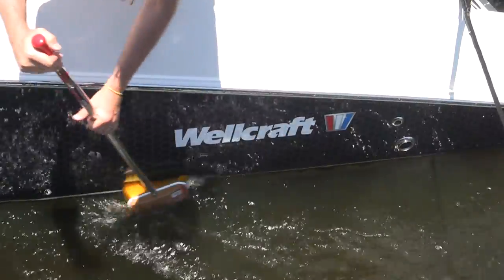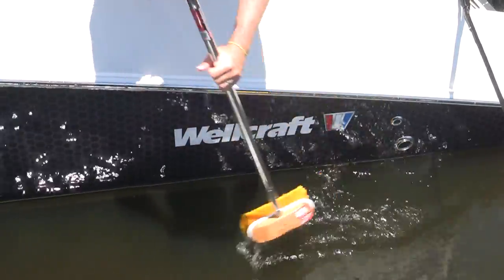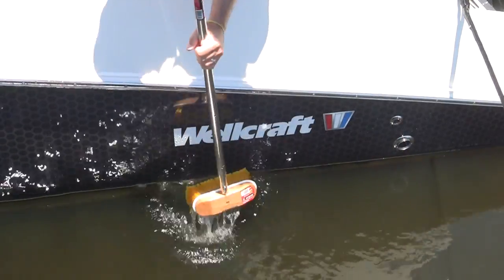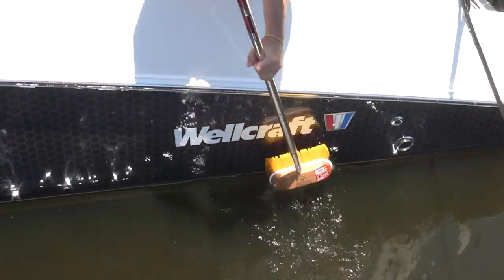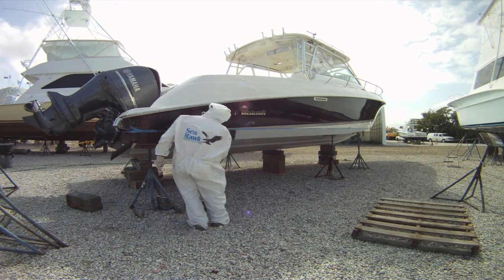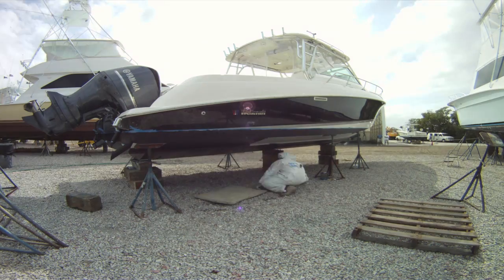If you're working with the softer style of ablative paints, you want to be careful not to smear them or be too aggressive with the brush. Only brush along the scum line above the paint from side to side, or use one-directional strokes in a downward motion. Pulling up could bring soft paint onto the clean hull sides. With our Seahawk ablative paints, this is not a worry, because this newer breed of ablative paints is hard enough not to smear.